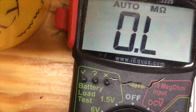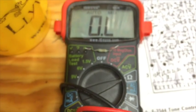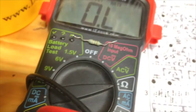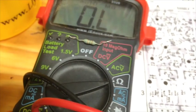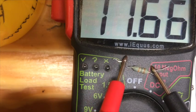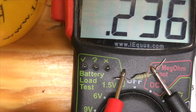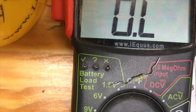I just want to show how I tested the resistor that I determined to be out of spec. This resistor here is the one that was actually causing the protection light to go on — this one and its opposite side counterpart. This is the 180 ohm resistor; it's R34 and R33 on the spec sheet. If I test this thing, it reads 236 ohms — 0.236 kilo ohms.